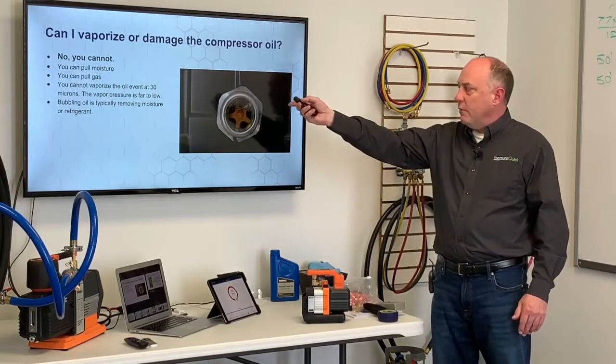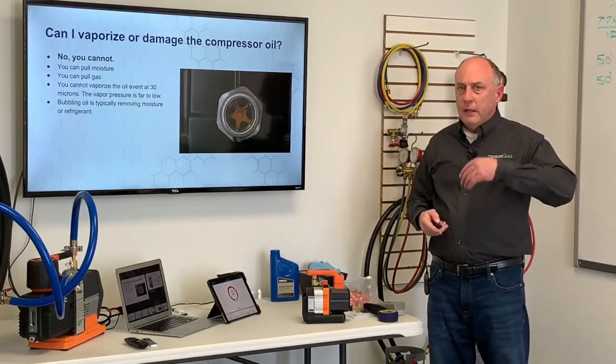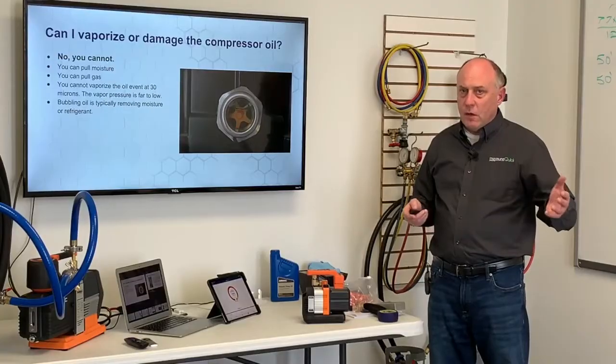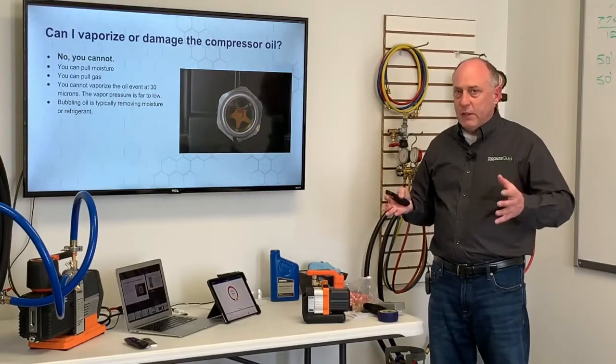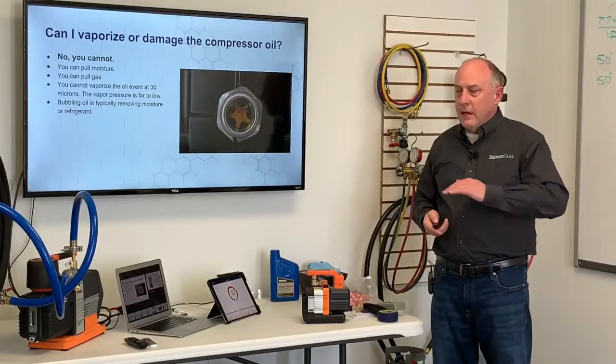The vapor pressure of refrigerant oil is far too low. When you see bubbling of the oil, it's typically emulsified refrigerant or emulsified moisture. It's mixed in with the oil and we're just boiling it out of there. But it's not the oil evacuating.